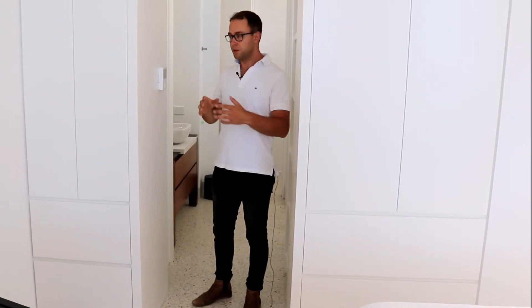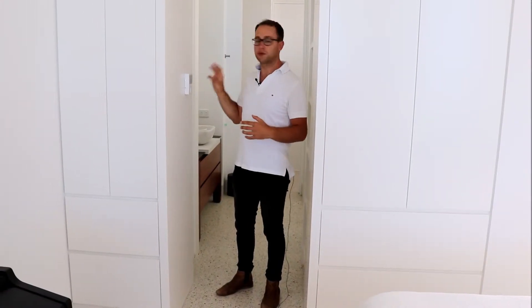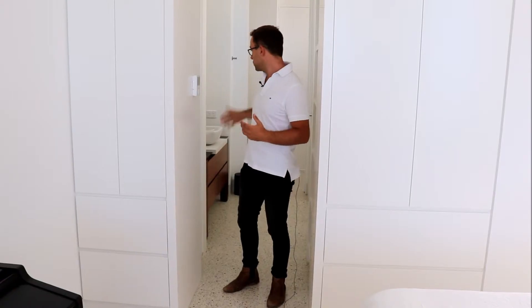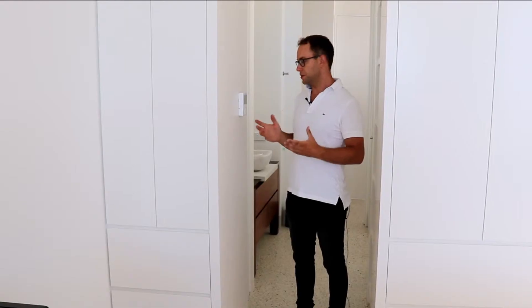For example, right here for this part of this house, this is one particular zone, and so the controller is positioned here sort of in between an important bathroom and a bedroom. This temperature senses not only the air temperature but also the radiant energy that it's receiving, and from this it calculates precisely what the room feels like, and according to that it can turn the floor heating or cooling on and off.